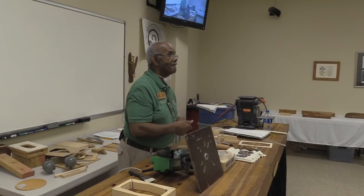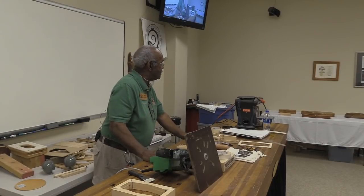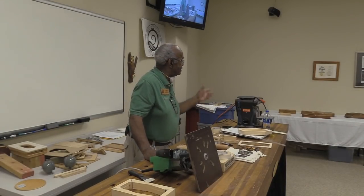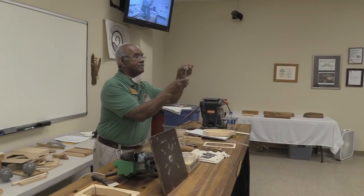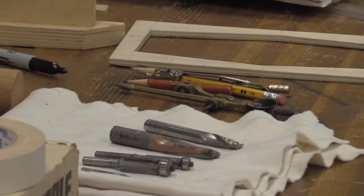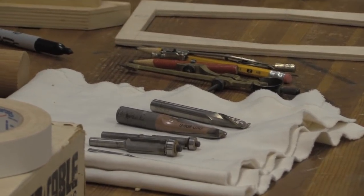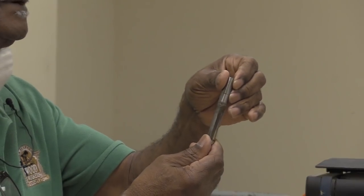For odd-shaped boxes like the one that almost looks like a violin case — did you cut the outside shape with the router also? Yes, I made up a template. On the outside of that, I use a different bit — I can use a straight bit and do the whole thing every time. But I don't want that straight bit in the middle of a wide piece of wood, so I take my jigsaw or bandsaw and waste away some of the excess wood first. Then the router is only dealing with maybe an eighth of an inch of wood around there, so you're not overloading it.